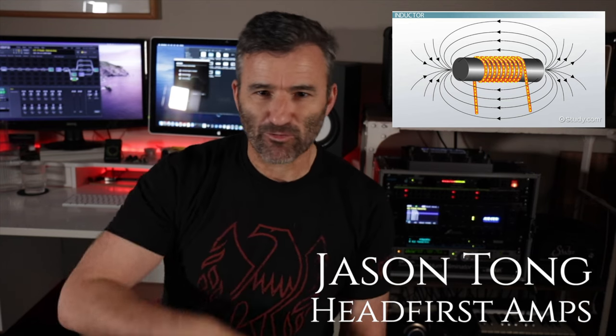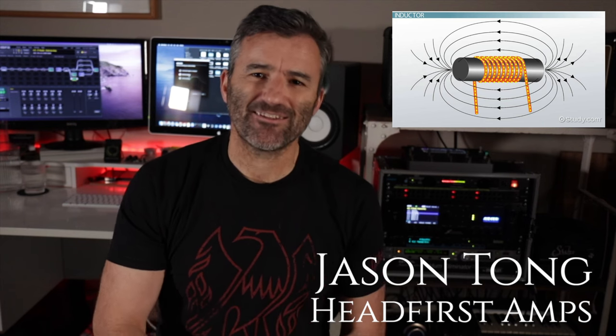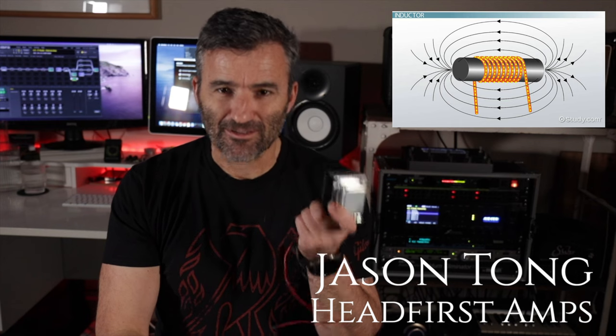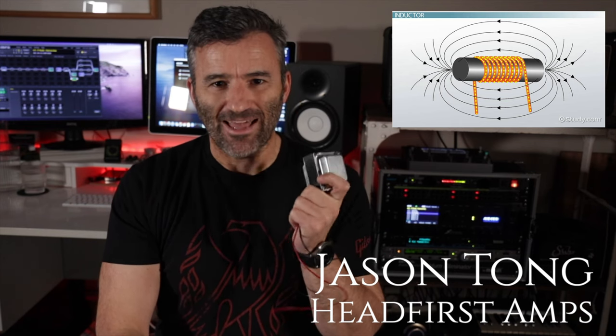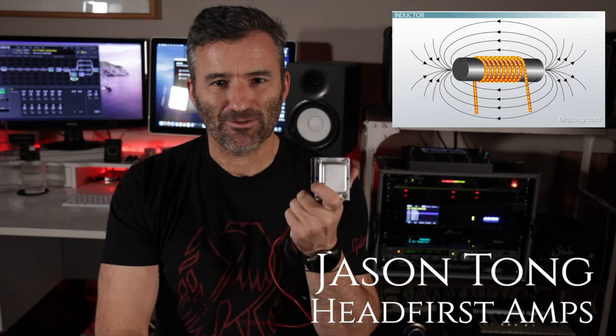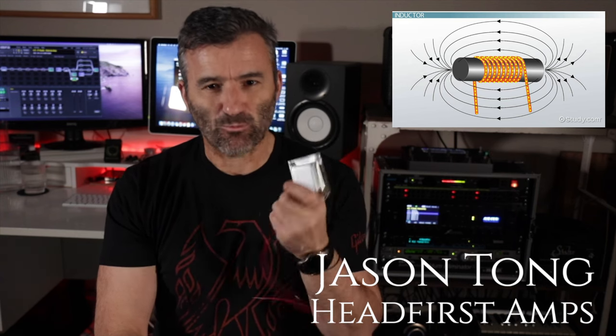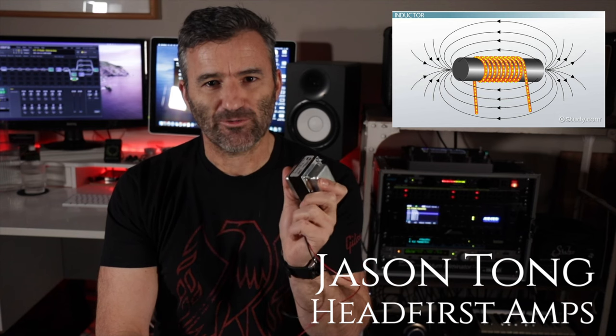You know, my 450 volts plate voltage, right? That's a DC. It has to be nice and steady. The inductor will actually repel AC current, right, and only allow DC to pass through. So it's wired in very early in your power supply, right?